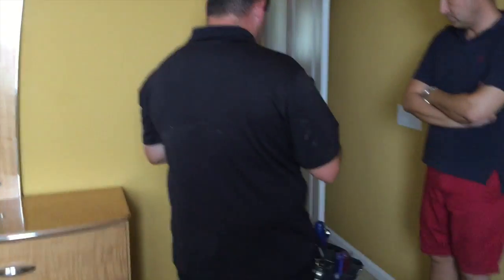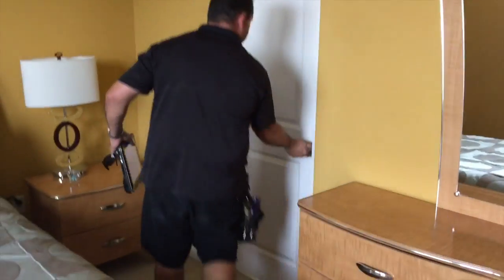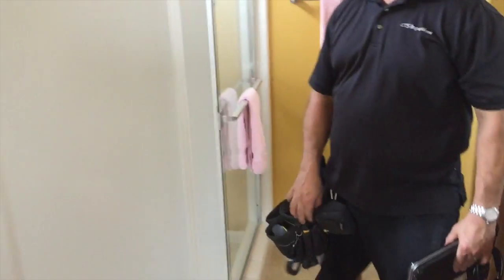Okay, next we're in the east bathroom, so we'll just do this right here. This is the east bathroom shower, and what I noted is you have one cracked tile on the shower wall adjacent to the window. With the corner there? Oh, I see, along here. Okay, so it's right where you would have some flex probably, if you get some settling and stuff right there from the window. Otherwise, it looks like everything's in really good shape in here.